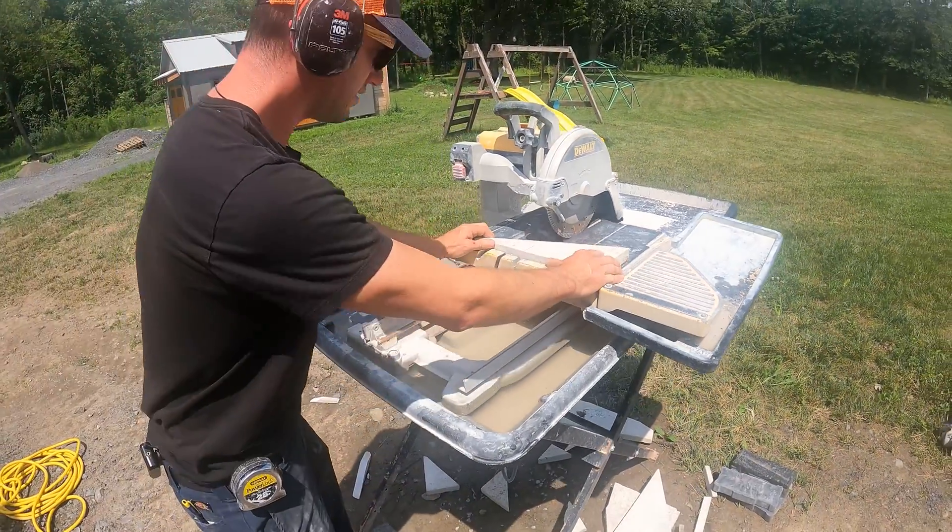Now with the black pavers, you've got to look to make sure they fit in — and you can see they do. This is a 10-inch blade. Let me see exactly how much it'll give at that height — about three and a half inches. If you need to, you can bring it up a little bit, cut from one side and cut from the other. I usually have it set up so that the blade is just below the top of the table. Keep your fingers away from this blade. Just for safety of this demonstration, I'm going to cut one that we've already ripped — just to show you how it cuts. Like butter. Look at that — cuts right through the stone. Amazing.